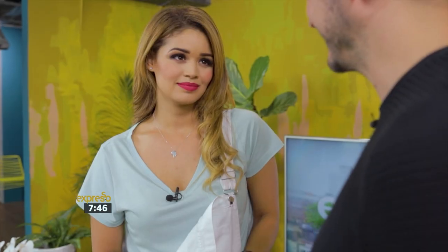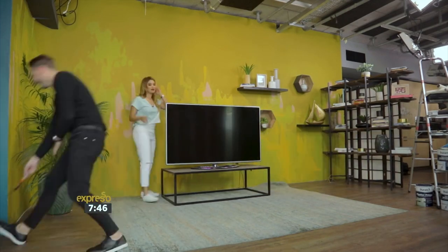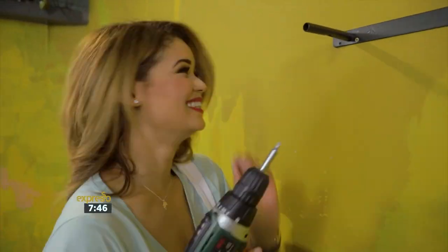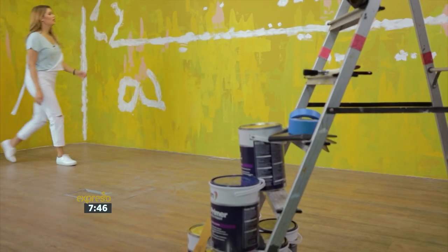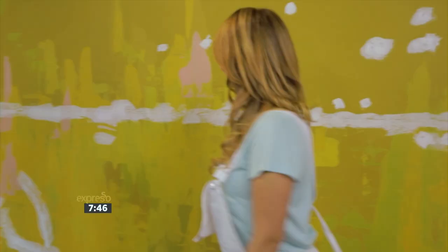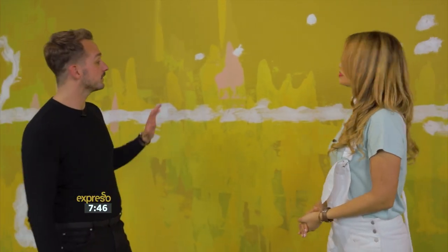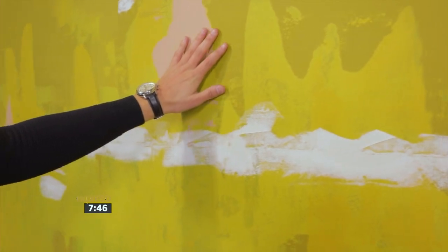I know we have a lot to get through, so what's our first step? Other than prepping the wall, we need to remove all the furniture. As well as the furniture, you also want to protect the floors. Then there's the matter of taking shelves off the wall, filling any holes or cracks there may be, removing any contaminants, wiping down the walls, and allowing to dry. Look at this clean space — it's incredible. Now that all the furniture's out and we've prepared the wall, it's important that we make sure the walls are really smooth before we actually add our primer.